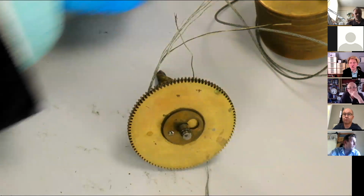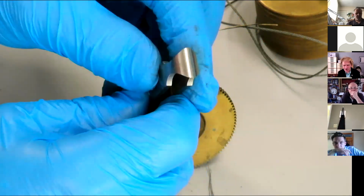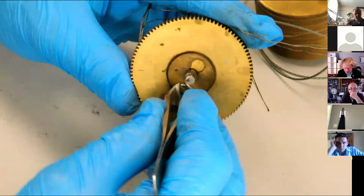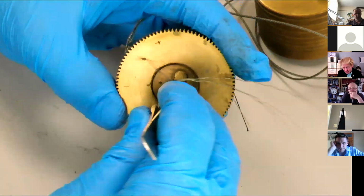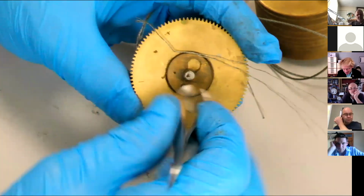Right, I'm going to try with my Savoy tweezers. I think they're called that. These badgers, they're incredibly useful for this kind of thing. They're balance spring tweezers for cutting really fine wire and things. But of course, you can see they're ground flush. So they're really useful for getting hold of something like that. I'm going to have to look through my eyeglass, I'm afraid. Yeah, that appears to be getting it. You can see these are incredibly useful. Best thing to do if you know a watchmaker is to borrow them from a watchmaker, but just don't tell them that you're going to be putting them anywhere near a clock. Yeah, Savoy is the name. I don't know whether that's the brand or the design. Maybe it's the brand. I'm sure some watch person will know.